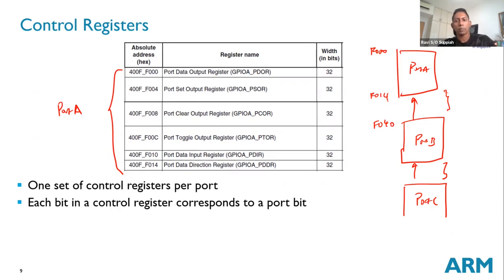Prevent overflow from corrupting other memory regions. Okay, in this case, we wouldn't say that might be an issue, because you will access these registers specifically to either update or read them only. It is not used as a spare memory region for you to hold other data or variables. These are all reserved only for peripheral subsystem registers. So that overflow issue might not occur here. But it's a good try.